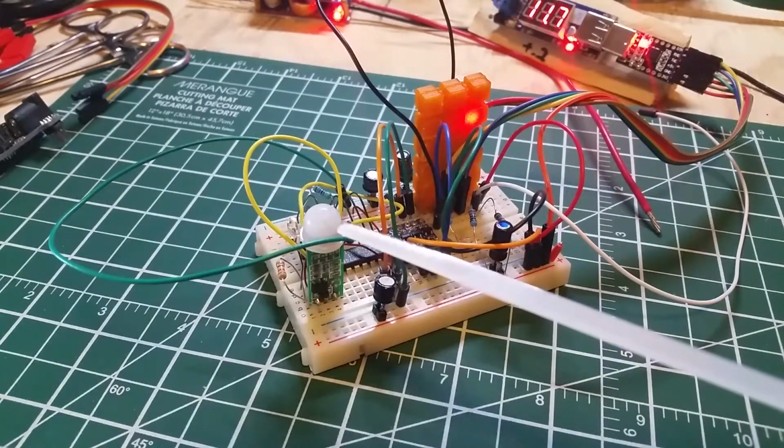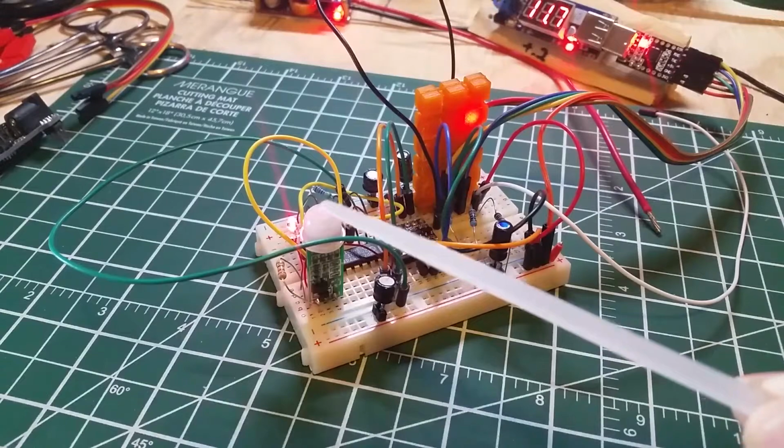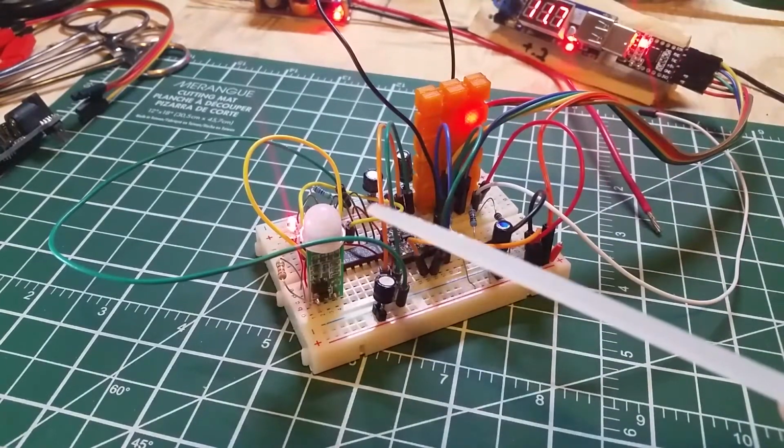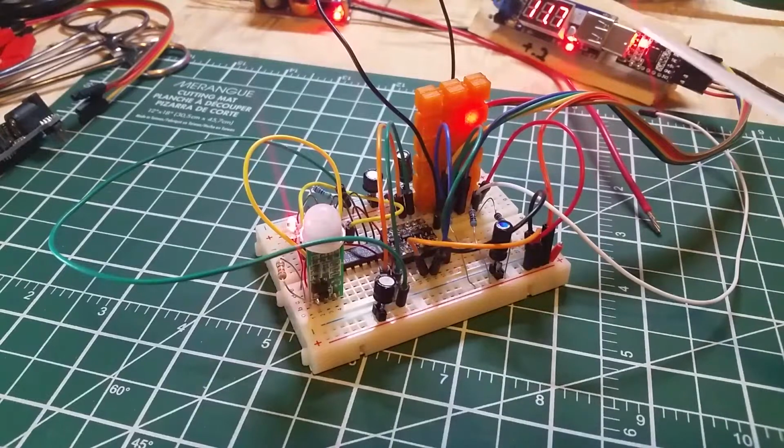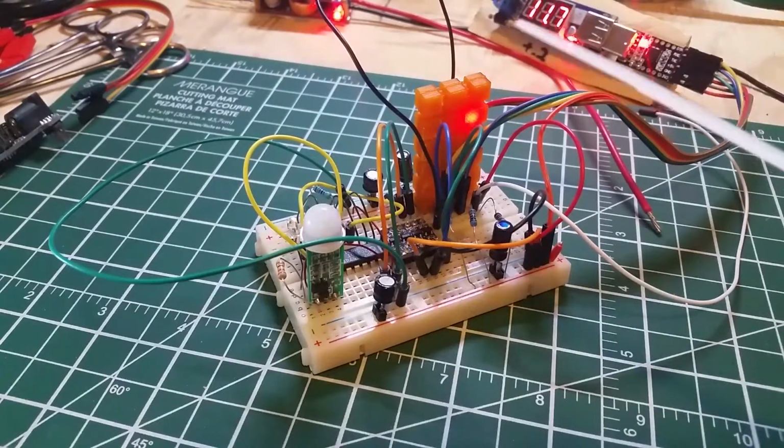I got that backwards. No, it wants it pulled high. Yeah. Oh, it saw the end of this tip. So actually, that's working. But as you can see, my 12.7, it's actually a rock solid 12 coming out of that power supply. There's something wrong in that module, not allowing it to give the full amount. So I'll have to have a look at it. I suspect something in the switching power supply.